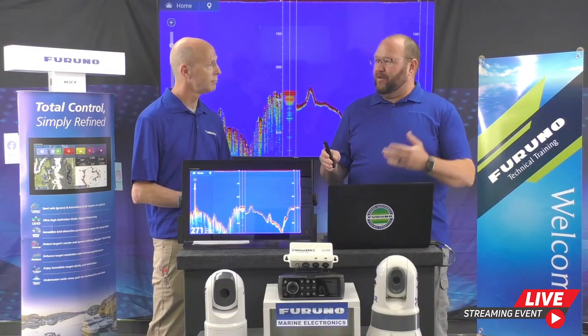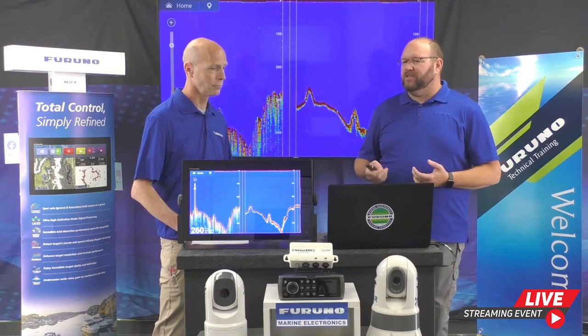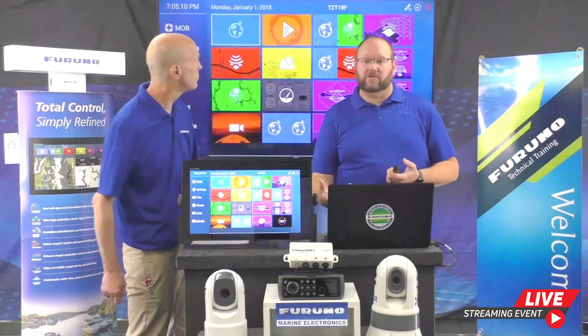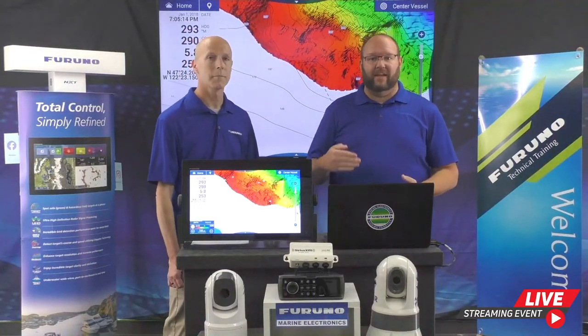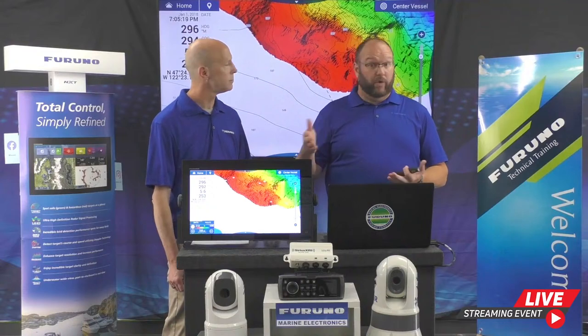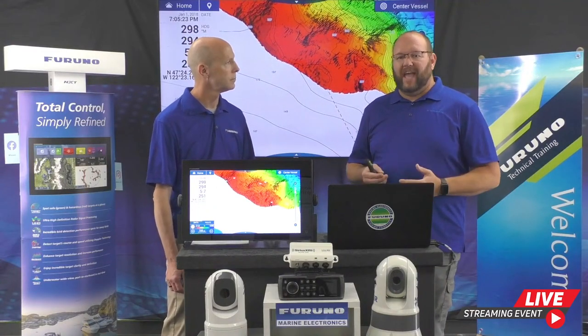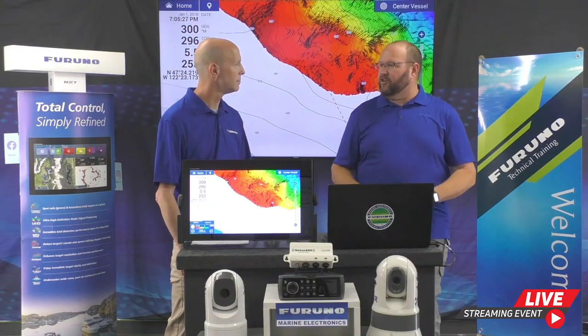Along with improvements that we hear from you guys asking for, or we find ourselves, one thing we noticed lacking was predatory fish over bait balls or under bait balls. So we did some improvements. When you're using the deep impact, the DFF amp, to give you that 2 or 3 kilowatt power chirp, or even higher in some instances with the TZtouch3, we've adjusted the gain.